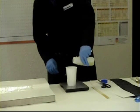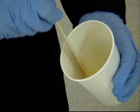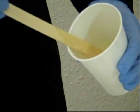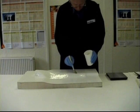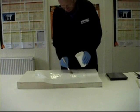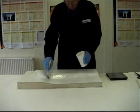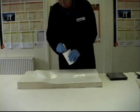You can now mix up the laminating resin. For this particular part, we're going to use 50 grams, but there is a guide within the instruction manual to help you work out how much resin you might need for a different size part. Use your scales to measure out the correct amount of resin and hardener. The resin is thinner than the gel coat but still needs to be mixed thoroughly and not too vigorously to avoid adding too much air. Brush on a thin coat of resin to the mould surface — this will give you a lot more time to put on the carbon fibre. This resin layer will help the gel coat to harden, help prevent any chance of delamination on the cured part, and will also help prevent any print-through of the carbon fibre itself.